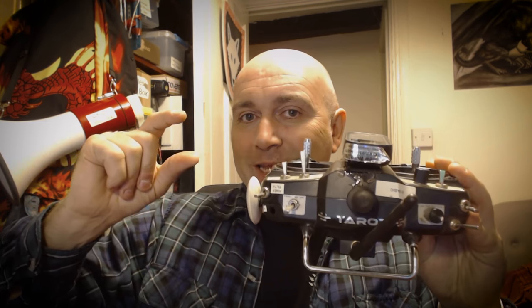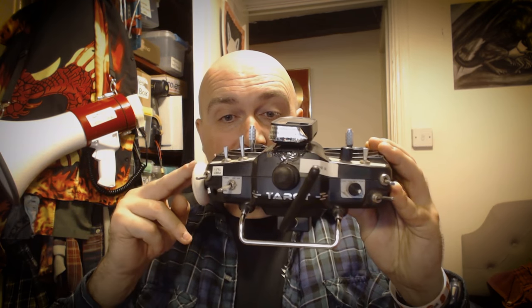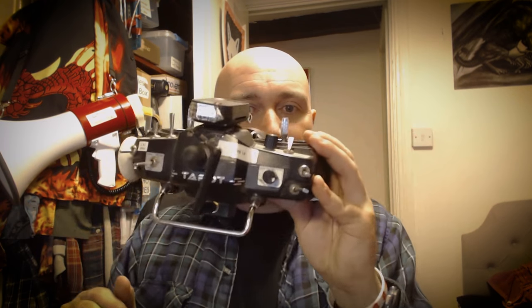Okay, now if you turn your gains down, okay, what'll happen is if I push it, it'll keep going. It'll go and slowly stop. That's with the gains down. You don't want that. That's wrong, because that means that the wind can blow it out of the way and it'll never recover. If you have your gain set too high, it means it'll come back too much.